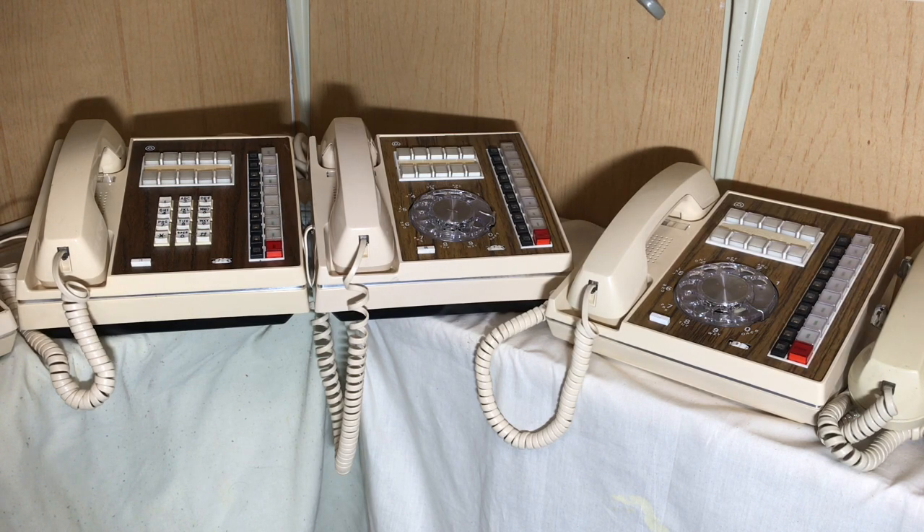The phone on the most left hand side is configured to make lines 1 and 2 operate. The phone directly to the right of the touch tone phone is configured to make lines 3 and 4 operate. Both of these primary telephone sets can be configured to operate 1 and 2 or 3 and 4 — it does not matter as long as one is set one way and the other is set a different way. Generally you would always have all rotary or all touch tone, but in my little museum setup I have one of each.